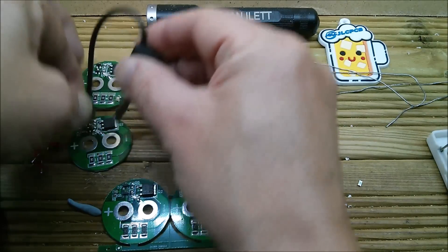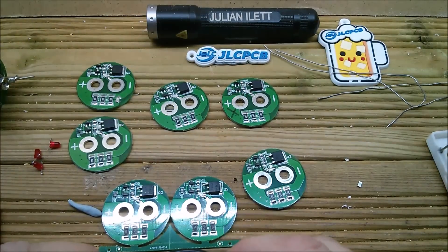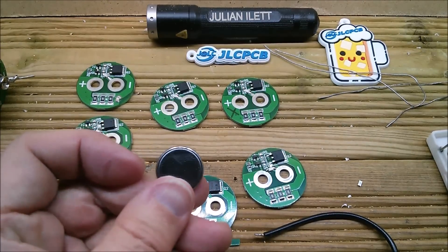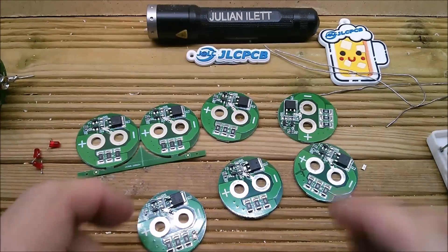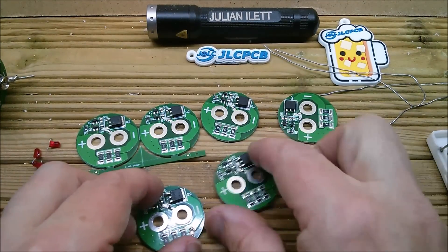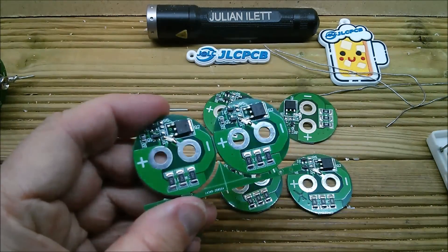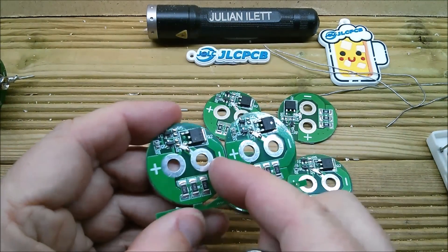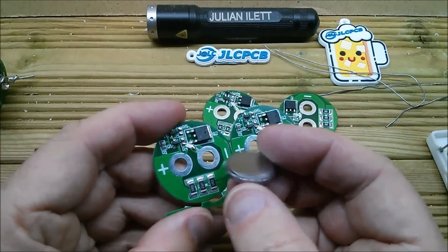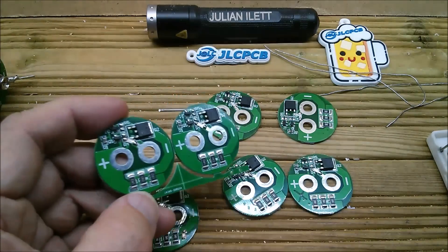Even the one with the X on has a blue LED — that's interesting. That one's quite a bit brighter. I wonder if that hints at some part of the circuit not working. Or maybe they just have different responses to that forward voltage. Some of these have had the track cut on the back and some haven't. On the ones that haven't, when I put three volts across positive and negative the protection circuit turns on and shunts some current through these resistors, which would explain why they're a bit dimmer.